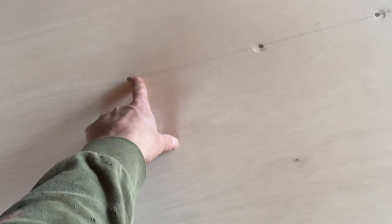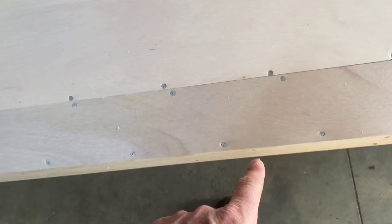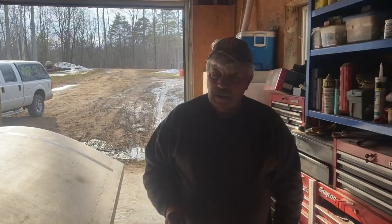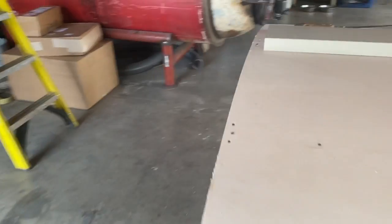And the next one on the other side is gonna do the same, and then there's gonna be a saddle piece going over top of that. And then we're gonna screw right through here, through both pieces of metal into the purling on both sides. I'm not sure if we'll screw the top piece there, but we're definitely gonna screw it here, and then we'll screw it down here on the fascia. Right, Terry? Absolutely. Get her done, bud. All right, that's what we're doing.